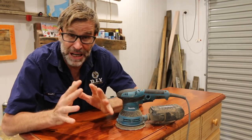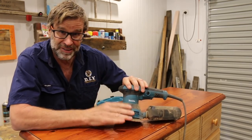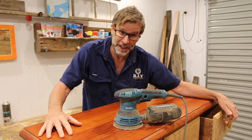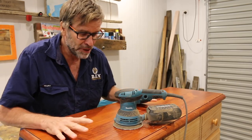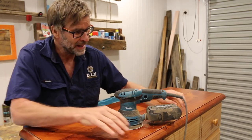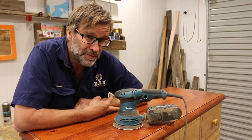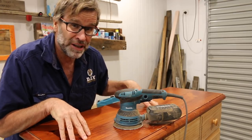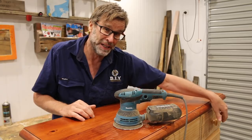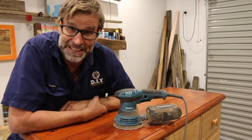So how do you go about obtaining that beautiful whitewashed effect? Well, it's really simple. What I'm going to be doing is with my orbital sander, I'll be sanding all this stain off and going back to the raw pine finish. Some people, when they're whitewashing and the piece is already stained or painted, will just give it a light sand, then apply the whitewash, and then in various places sand a few little bits off here and there, which will bring the underneath colour up and through, giving off that aged appearance. For this project, we're after the Scandi feel, which means going back to the raw pine, and when the whitewashing paint has been applied and dried, the grain from the pine will come through, giving off that beautiful Scandinavian appearance.